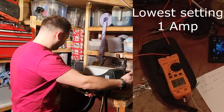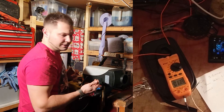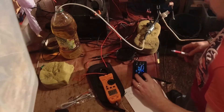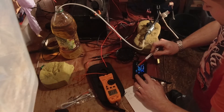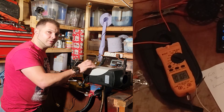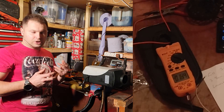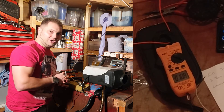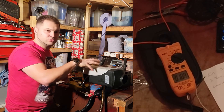I'd say if you left this on overnight you'd be getting really toasty. On this model you can put it into night mode — you press the cog button and the OK button together, and up in the corner you'll see what looks like mountains, called plateau mode. What this actually does is slow down the feed of the pump to reduce carbon monoxide build-up from the exhaust. In normal mode this runs as a five kilowatt, and in plateau mode it actually lowers down to a two kilowatt.